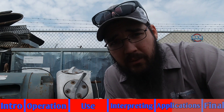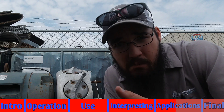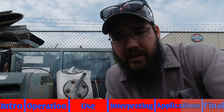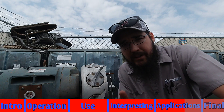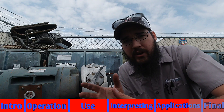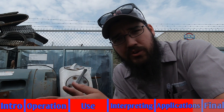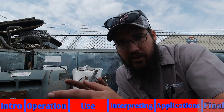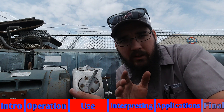I use this all the time when it comes to any kind of blower motors, compressor motors, just any kind of motor — if it's a motor, this can be used and utilized. It's an extremely effective tool that not very many people understand or are comfortable with. The reason I also recommend waiting 60 to 120 seconds is because there can be degradation in the insulation reading as you let that voltage sit on the insulation. You're allowing degradation to take place, and that's why the reading may slowly start to drop off little by little.